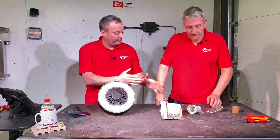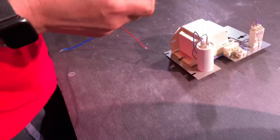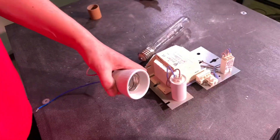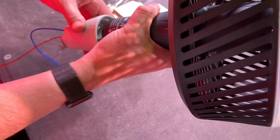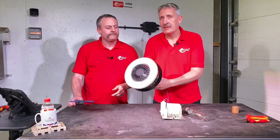When you say fast install, let's bring the two side by side and you show me how I'm going to fit it in. Okay, so inside the fitting there'd be a traditional lamp cap — this is an E40 lamp cap — and the lamp screws in there. So it's a case of just taking the lamp out and bringing in the TrueForce and screwing that in. This is quite a lightweight retrofit so it's not going to stress the lamp holder. There's a solid lump of ceramic there, and that's it — that's the retrofit done.